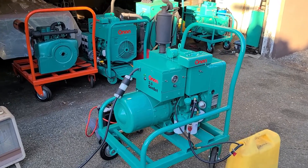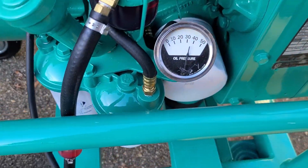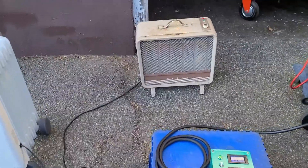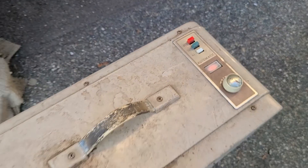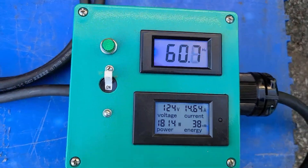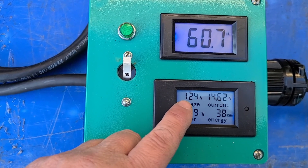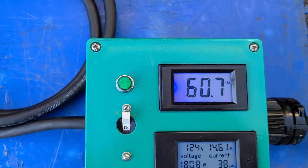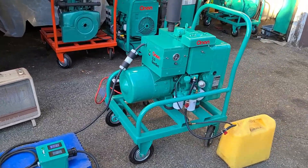We're back — got this thing running and it's running well. We loaded one heater on it — that guy right there — on high. We've got 1,800 watts, voltage is good at 124 volts, and the hertz is perfectly acceptable. We expected the 1,800-watt heater to run no problem.